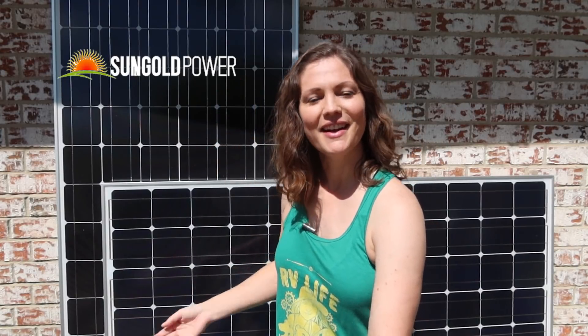Now let's talk about the different types of panels. You've got monocrystalline and polycrystalline. Monocrystalline is and always has been a little more energy efficient because of just the way that it's cut, as well as in the actual physical size of it — you can get more cell in less real estate. Monocrystalline cells are square. These SunGold Power PV panels are monocrystalline. Polycrystalline cells are usually a little bit rectangular. The difference in efficiency between the two is just a little bit; however, monocrystallines are slightly more efficient and slightly higher in price.